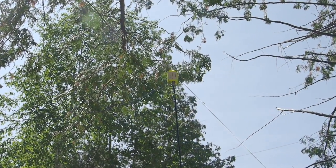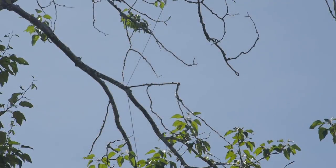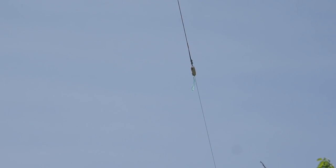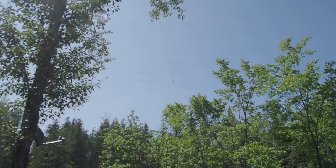The unun is about 15 feet high. You can see the main antenna going off to the right and the counterpoise to the left, going up over a tree limb that's about 30 feet up in the air, then coming back down. There's the insulator at about 20 feet off the ground, and that wire goes off to a tree in the background — so that's the setup.